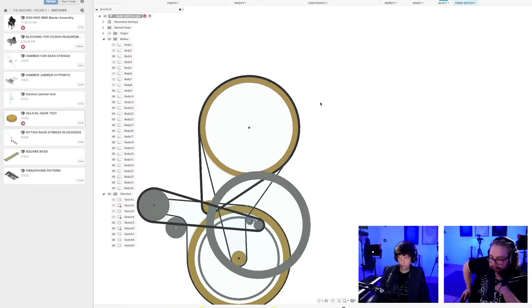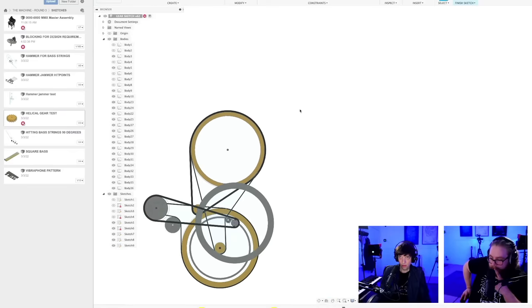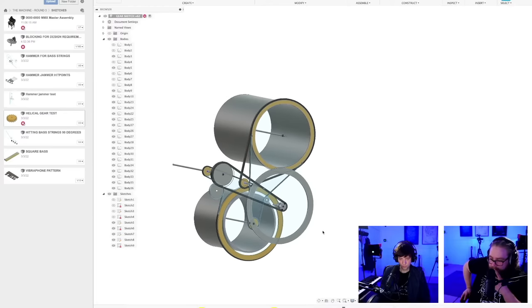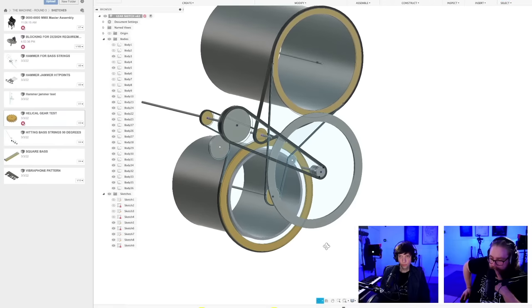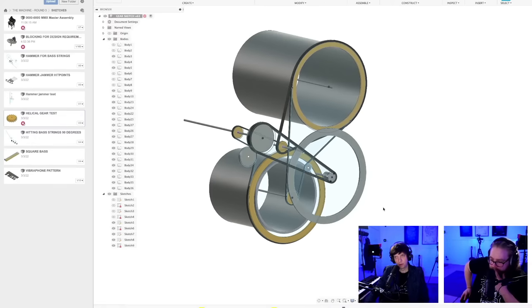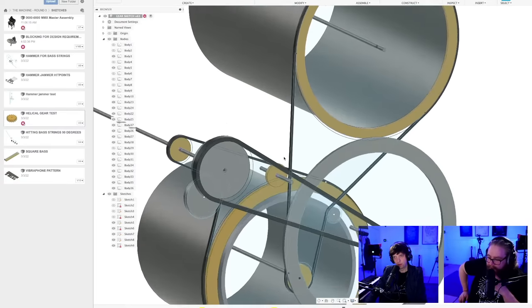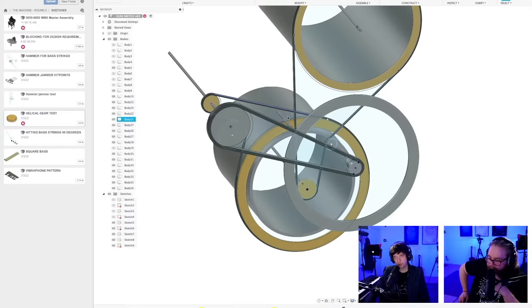Mandracle: no, it has two sides. It's not a Möbius strip. Yeah, which should mean... Mr. Gonsonator: offset the axis angle and the crossed belt will not touch. You could even have a tensioner on both sides with flanges that lightly pull them apart, perhaps. Lucas Wendel: crossed belts can't be tensioned properly without it chewing itself up or requiring a lot of idler wheels. Yeah.